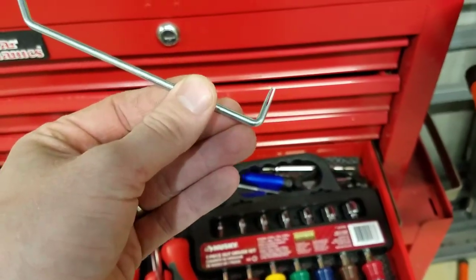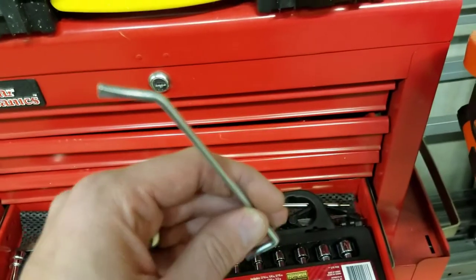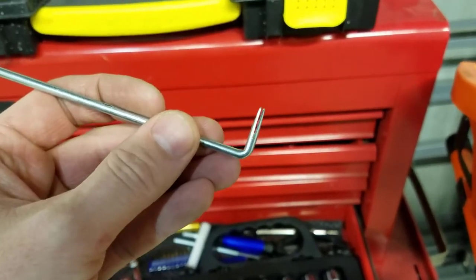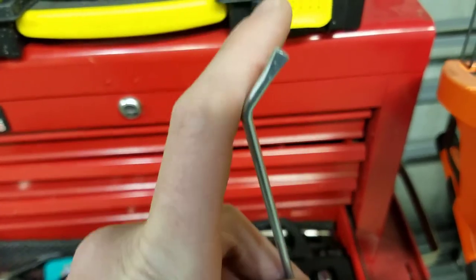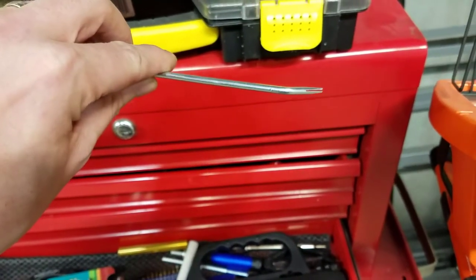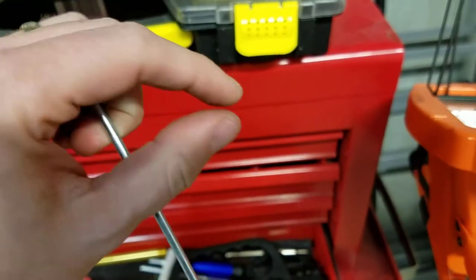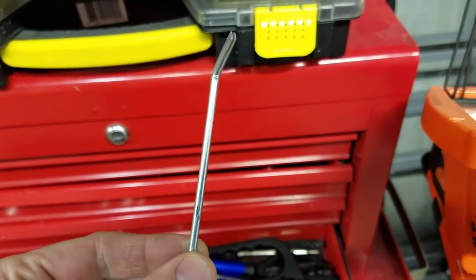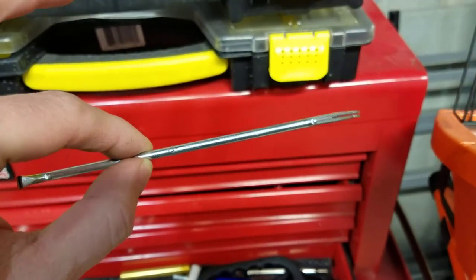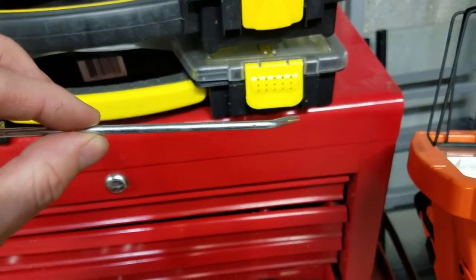This tool doesn't look very cool, but it's actually a copper leaf switch adjustment tool. It works great if you've got a switch that's not making contact, not gapped appropriately, or has been mangled. It has a slot on both sides — you stick it into the part of the copper leaf you want to adjust and twist it to either gap it appropriately or bring it back into shape. You can buy these online — Pinball Life has them and I'm sure Marco does too. You could use a flathead screwdriver, but if you want to do a lot of them quickly and get a nice bend, these work great.